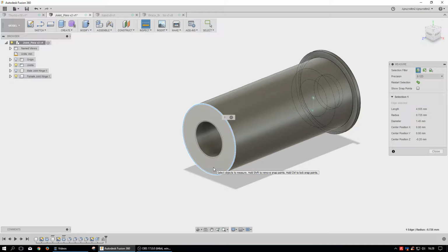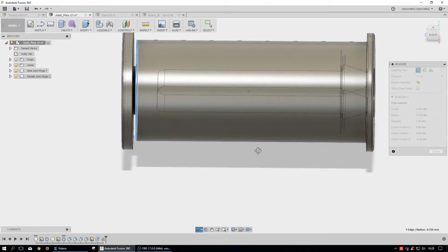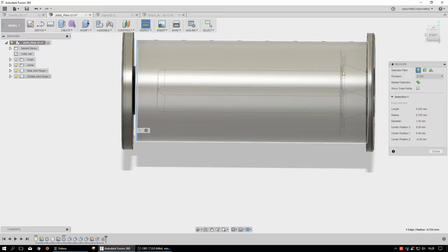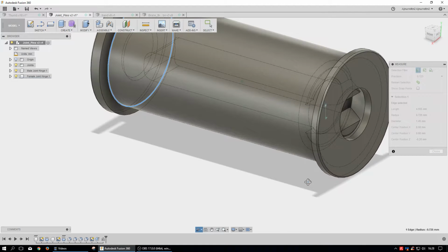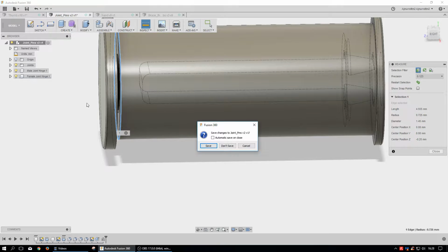They just have to hold the part together. They have to hold part of the thumb together. And so I don't have to worry about that too much. I just wanted to have enough gap here so that, you know, expansion while it's printing and all this other stuff, it wouldn't bind up. But we may have the problem down here. I don't know. It's all an experiment. So those were the joints.